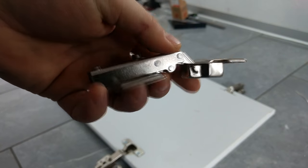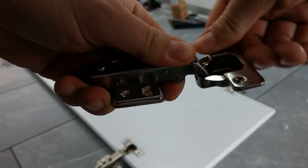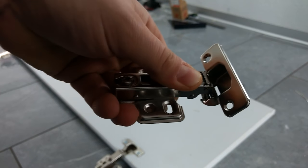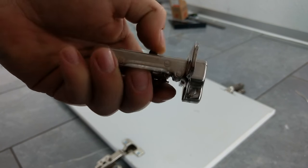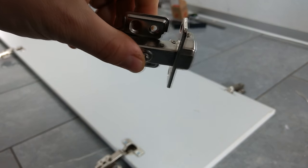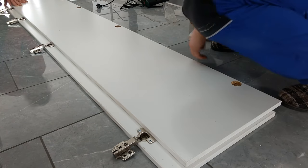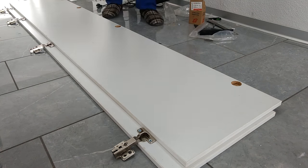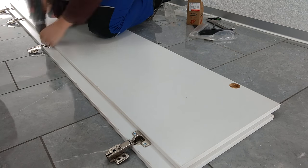The hinges for the door have a built-in pneumatic cylinder that allows for a so-called soft-close feature. They require a hole in the melamine to be drilled with a drill press, but since I don't have one I had them made at the store. To align them straight I used another door piece to push on all of the hinges at the same time so they can be in one straight line. To hold the hinges I used two of the 16mm screws.